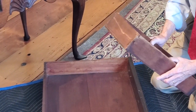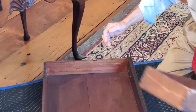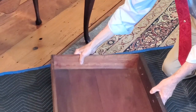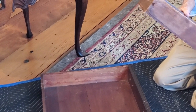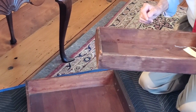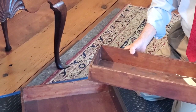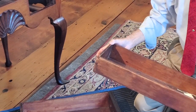Another interesting point is that the drawer sides protrude a little bit beyond the drawer back — that's the case in both drawers. Sometimes cabinetmakers would plane this extra wood off to give a more finished look, but it was just not the standard operating procedure in this shop. So we can see they used a square top, typical Newport drawer construction, and just didn't get into the fine finishing details of cleaning up the back and the top of those dovetails — both are really signature points of the person who did the dovetailing.